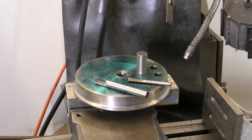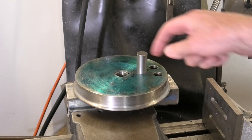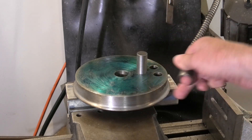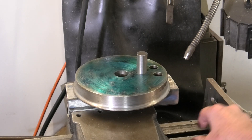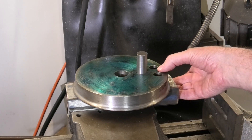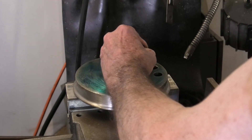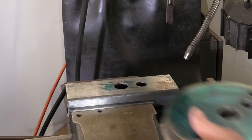The jig itself is quite simple. Just a bit of RHS that's held in the vise. That sleeve is used to centre the wheel on the jig, and then taken out - of course you don't slot with it in there. I use two big clamps, one either side, to clamp it in. Take that pin out. Dead simple.